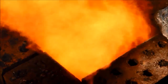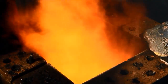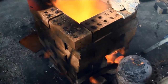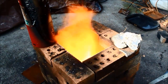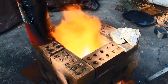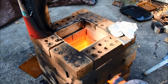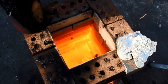I put another row of bricks on the top just to give it a bit more depth for that extinguisher bottle I was using as a crucible. As you can see, the burner just way overpowers the size of this furnace — it would easily do something much bigger. I'd say probably 100–120 kilowatts or something, nothing like what the burner is capable of. I've got the extinguisher bottle there that I want to use as a crucible, just to dry it off and burn a bit of the paint off it, and the same with that bit of aluminium sitting on the side.